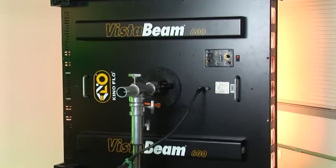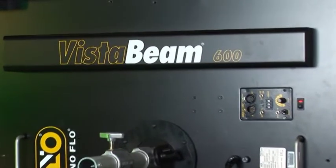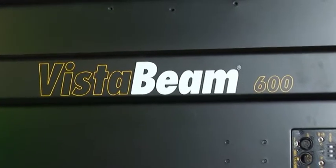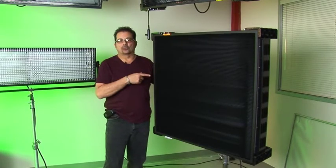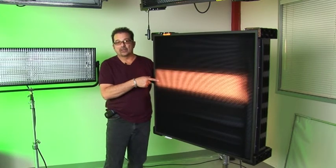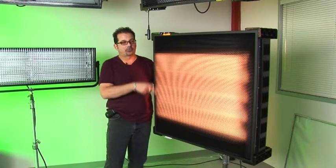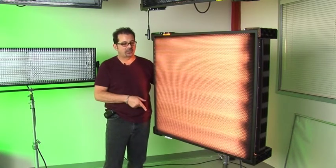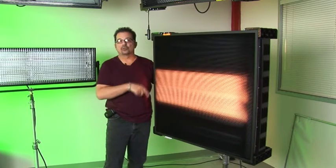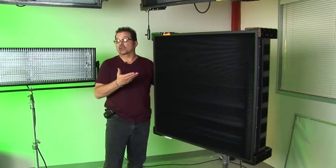It works like our select systems to avoid color shift. This is a 6-lamp fixture. Running manually, it starts with lamp 1 in the center, then uniformly adds 2, 3, 4, 5 and 6. As you reverse that order it does the same, keeping all lamps together in a uniform fashion, allowing you to have 6 lamp levels without a color shift.